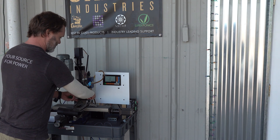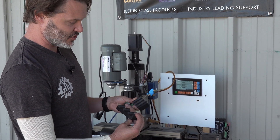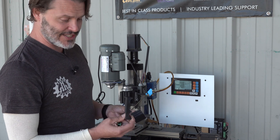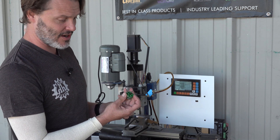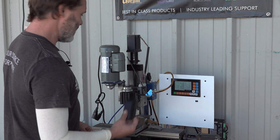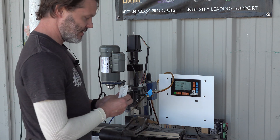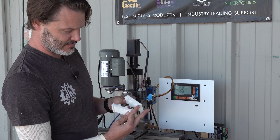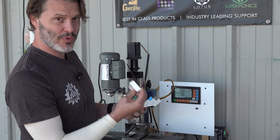What we have here to hold our armatures is actually just little 3D printed holding jigs. Originally I was going to machine something into the jaws of the vise, but realized that the stiffness needed for this operation — because of how flexible these shafts are — actually doesn't need to hold that strong. So we just 3D print these. This is for the regular 540 size armatures, and this one is for our magnum size armatures — just a different size. These are printed out of PLA, nothing special, but they are printed with 100% infill.